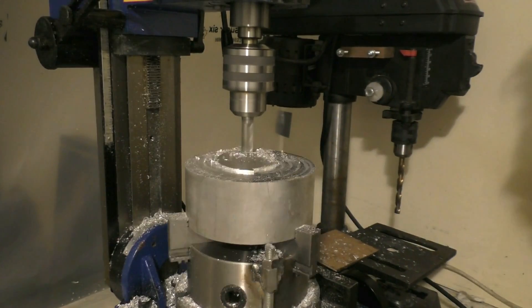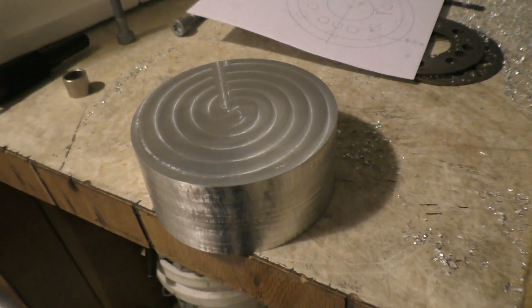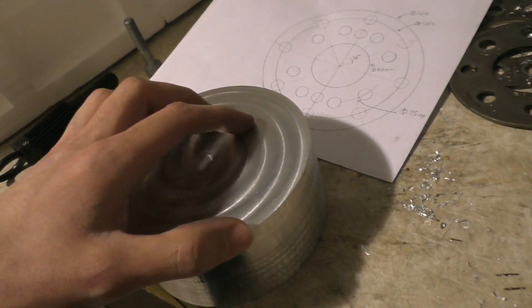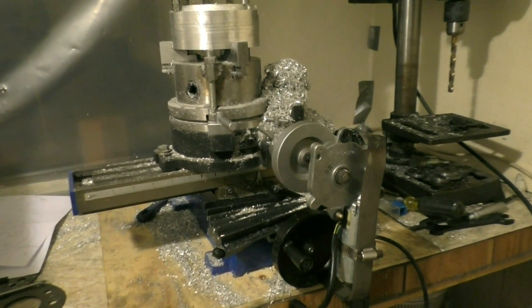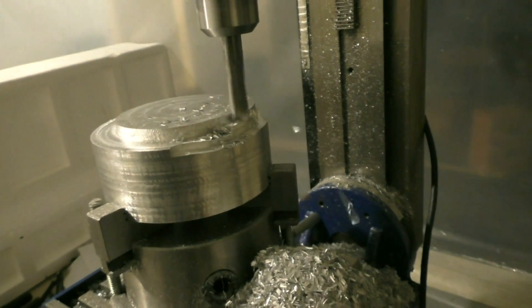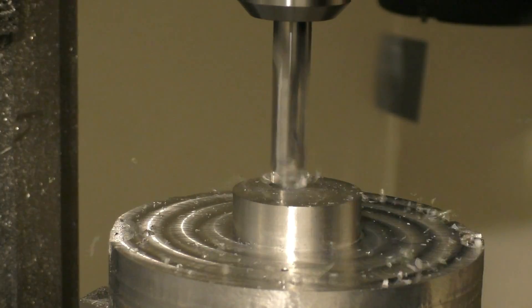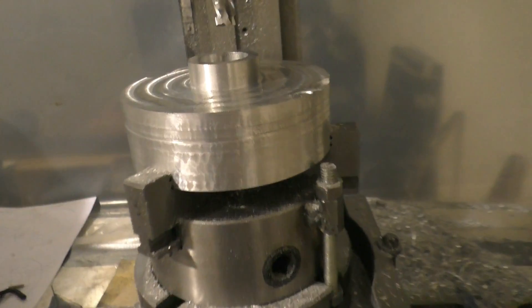I started off by cutting my aluminum piece into a perfect cylindrical shape — this was the bigger one for the 350Z side. After leveling the top and bottom surfaces, the goal is to make this side an exact replica of the 350Z crankshaft end. I measured some sizes from the engine I pulled the transmission from and got the rest of the measurements from the flywheel. Since I was too lazy to machine the whole thing by hand I connected a motor from the E55's panoramic sunroof to the turntable so it would turn and cut the part automatically — this actually turned out to be a pretty good idea. Once most material was removed I got to removing the center section to make the hole where the pilot bushing would go, and you can slowly see the part taking shape.